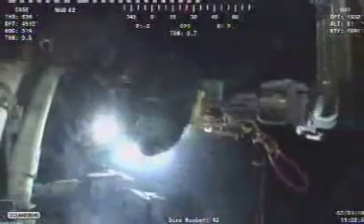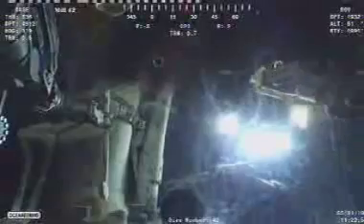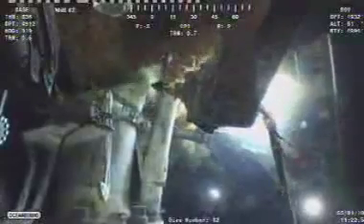This is certainly changing the nature of the oil coming out of the riser — it's somewhat obscuring their vision. I wonder if there's something coming out from underneath the strap; there could be a kink, there could be a crack exactly below the strap. I'll pause here and we'll come back when there's more to see. It looks like they're going to bring the saw to complete the cut — they tried to wiggle the retainer strap off but it's not coming off, so they're coming back in with the saw to finalize that cut.